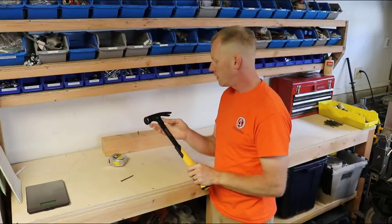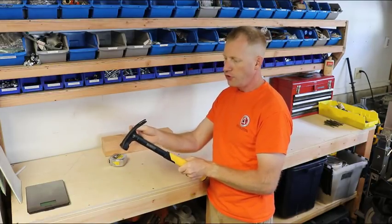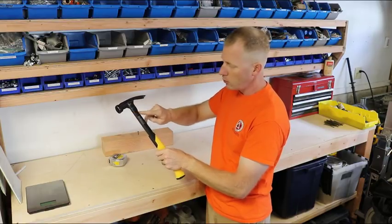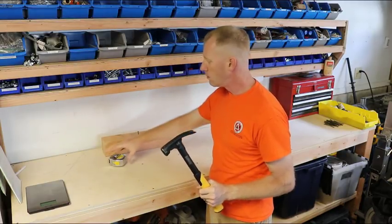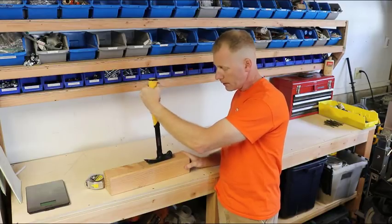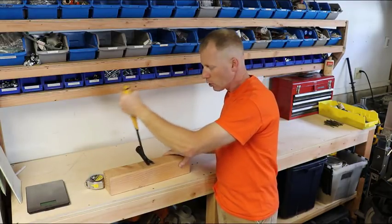Some of the disadvantages: because it is a thin steel shaft or shank, there's no place to drive a nail on the side. When you get into a tight area, you're always going to be about a half inch shy of sinking the nail — and you're probably only able to attempt it on one side because of the radius rib pattern. You're probably not going to have much luck with side nailing. Also because of that design, there's no way to pull a nail off to the side on the cheek of the hammer the way you can with a traditional hammer. It does have a corrugated deformed rib along the neck, which should make it fairly durable for pulling side to side.